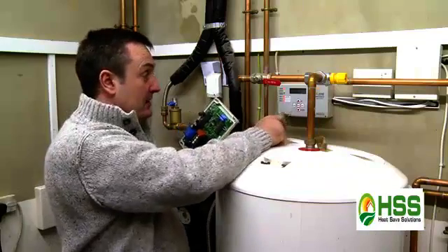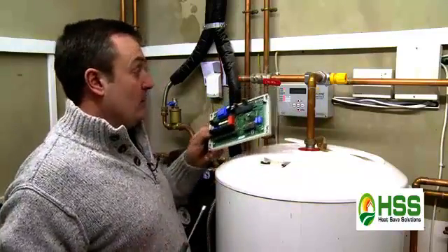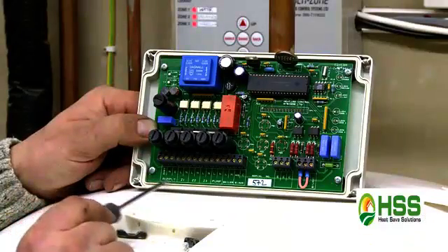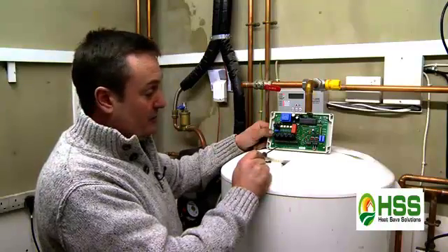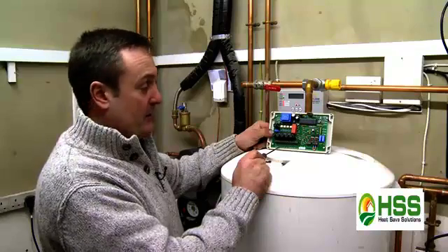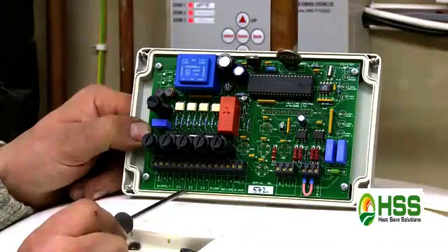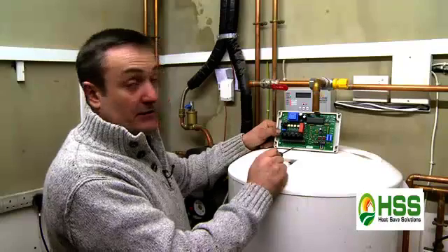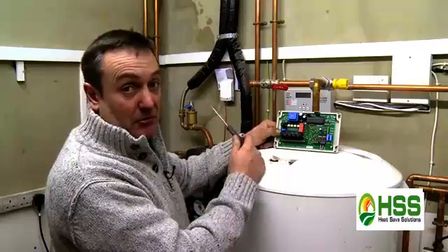The existing programmer was here, so with all the wiring there, it makes sense just to replace it like for like. On the back of the unit we've got our live, neutral, earth in — just our supply. With zone one, we've got a live and a neutral; the live goes to the cylinder stat, when that makes a circuit it livens up the motorised valve which then opens up. Zone two, just send a live wire to the room stat; when the room stat makes a circuit, it livens up the pump. Zone three works the same way as zone two, but all three of them systematically turn the pump on on a primary call.